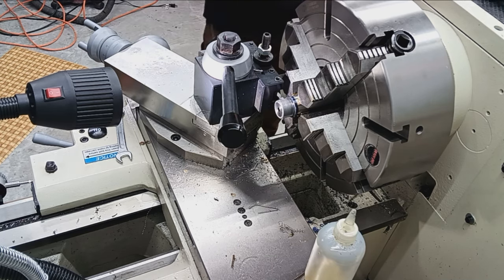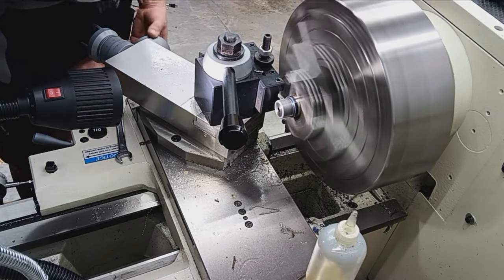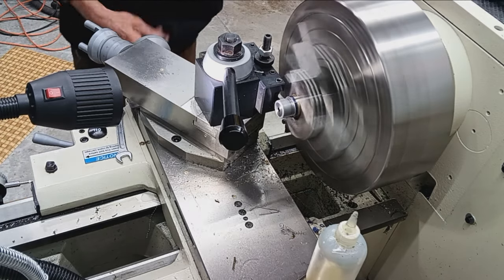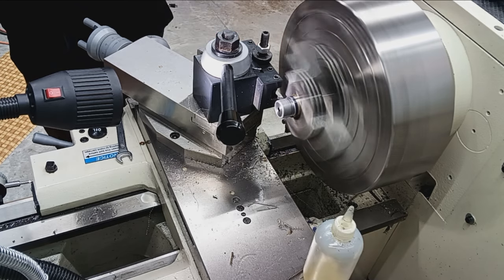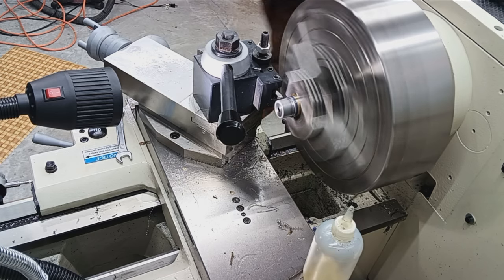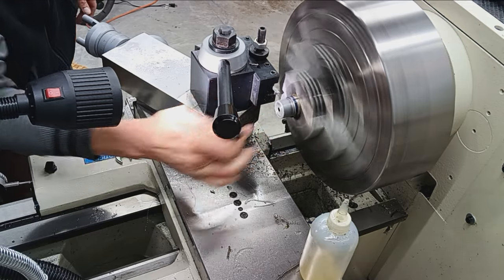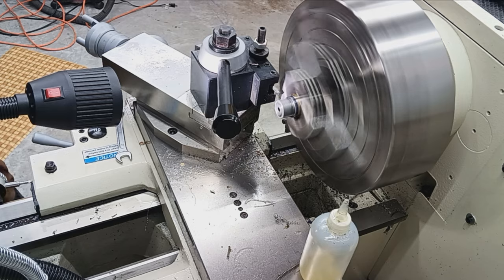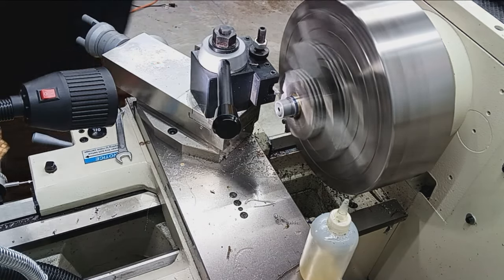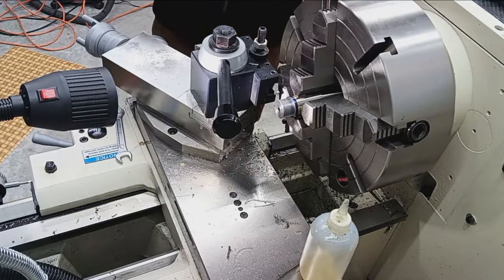Okay, right there. We're going to speed the machine up. Speed up. And take a pass. Pull that off. Just going to cut a slight chamfer here, so we're not reading off of a bump there. Slight chamfer. Blow everything off. And we'll take a measurement. Now I've got a clean surface mostly to measure off of.